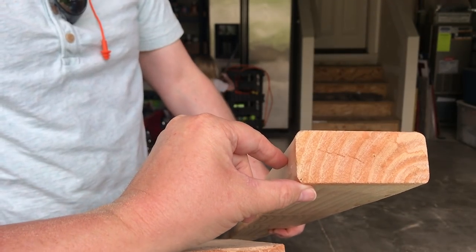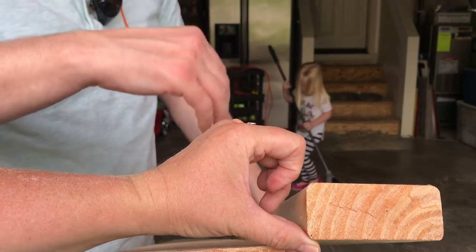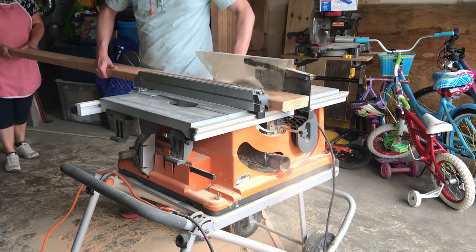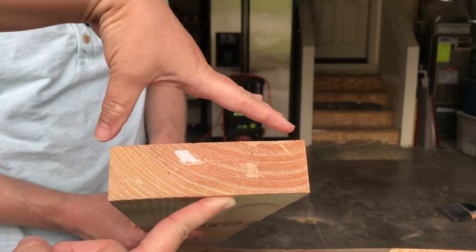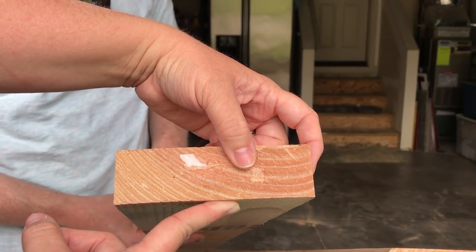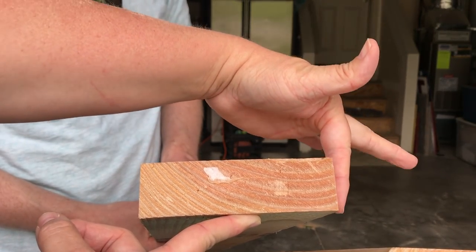They call it a crumb catcher when you have this little soft edge right here. So when you're putting all these boards next to each other, then the crumbs are gonna fall down in and create a divot. So what we did is that we took off a 1/4 inch on each side of the board. The boards are 2x6x8, and we took off a 1/4 inch from each side of the board, but then you had to account for your blade width, which for us was 1/8 of an inch. So that's kind of the math that we kept having to do for each of the boards that we cut down, but it creates this really good streamline look.